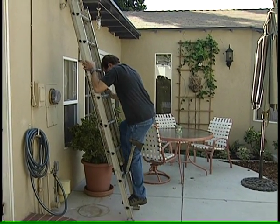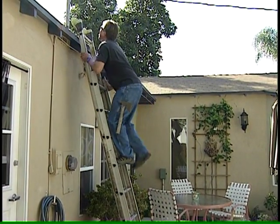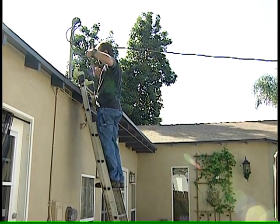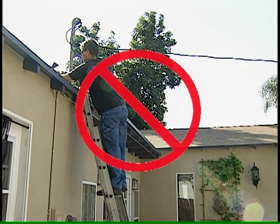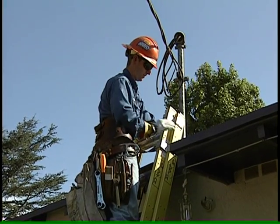While painting or cleaning gutters, ladders should be kept away from electrical wires. I was leaning on something and I created ground through my chest right at the point of contact. That gave me a pretty good shock — more than anything else I had ever felt. It was only 120 volts, but it got me pretty good. More people actually get killed with 120 volts than with the higher voltages we encounter, but obviously there are a lot more opportunities.